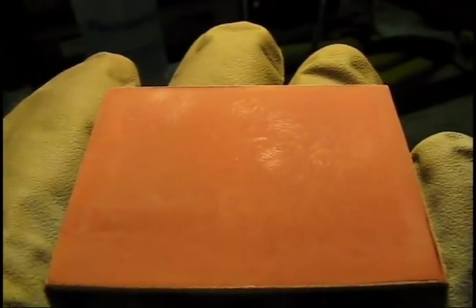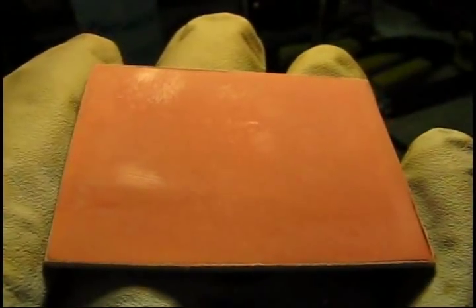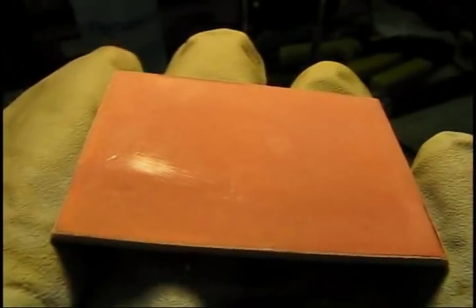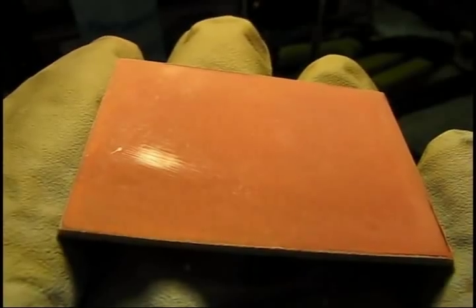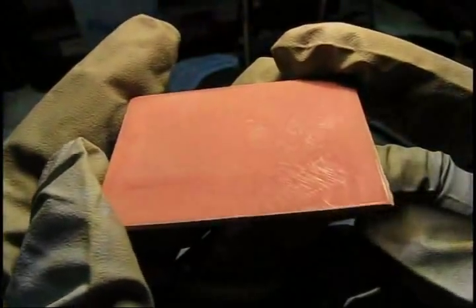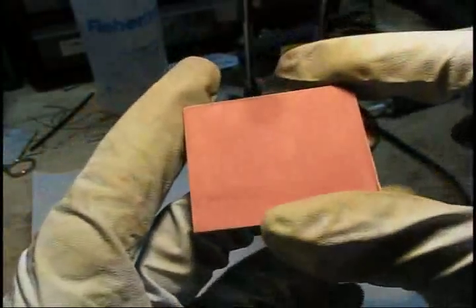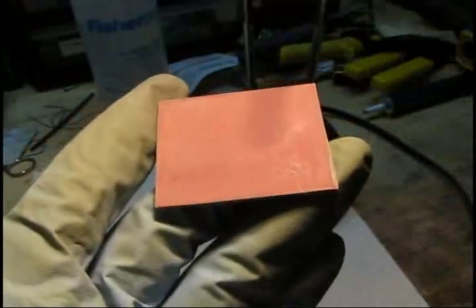You'll notice that once you've completed your pre-etch, the entire board will be a nice dull red color — not extremely bright but more like rust — and you'll notice that any imperfections in the etch will become apparent. You can see here on camera towards the left there's just a small little visible copper patch that's not visible head-on. If you hold it at an angle you can see a few areas that weren't thoroughly etched. However, if you look dead-on there are no large patches of un-etched copper, and this is a good sign. Once you have a piece of copper clad prepped like this, you can move on to the actual toner transfer.